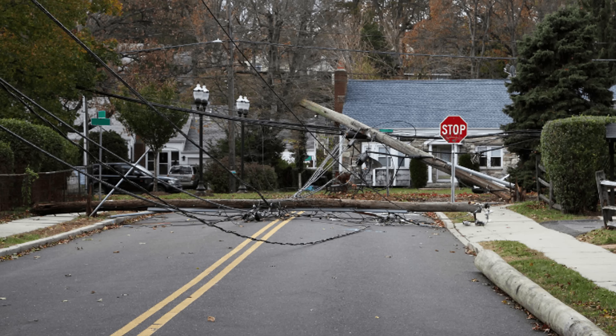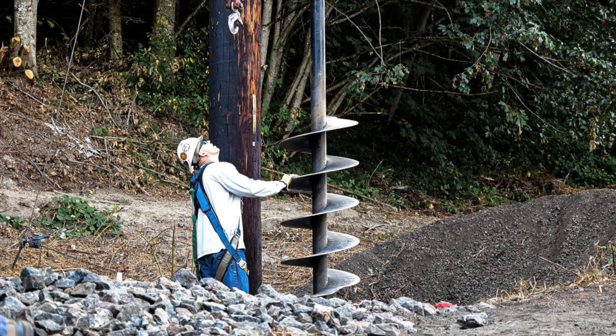We're gonna run to the hardware store to pick up a couple of number two six-by-six ten-foot-long treated posts. We're basically gonna cut those in half, dig some holes in the ground, and put the posts in there similar to how they do telephone poles. I'm not gonna be using concrete - I'm just gonna set the posts in there and then backfill the dirt, pack the dirt in as I backfill.